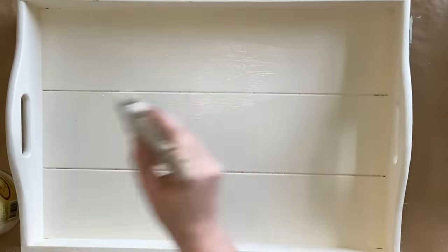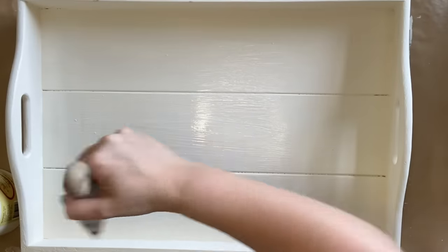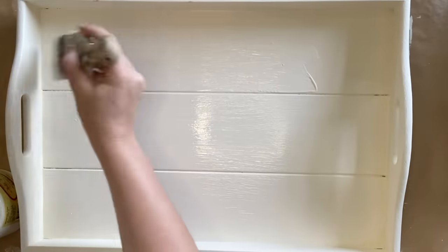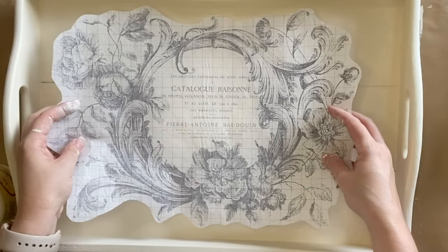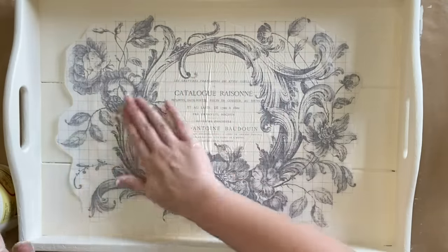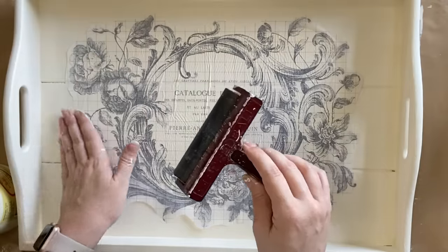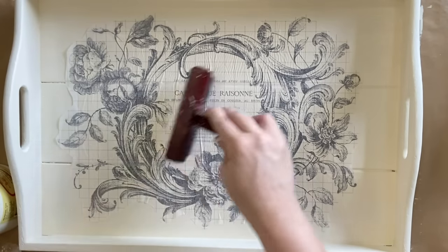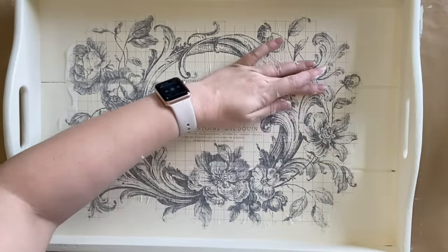Next, I'm going to apply an even coat of Dixie Belle's Silk Mineral Paint to the entire surface of the tray. I need it to be thick enough so that the paint inlay has something to actually transfer into and so that the paint doesn't dry too quickly — you must apply a paint inlay to wet product. I'm working pretty quickly to make sure this doesn't dry too fast, but I also need it to be even. Now I'm carefully pressing the paint inlay design side down into my wet paint. You should see the grid facing up at you, and I'm very gently pressing the inlay into my wet paint. You don't want to press so hard that you start moving the paint underneath, but you do need good contact. So I'm using a combination of my fingers and a brayer. This tray has little gaps between the bits of wood, so I'm going to very gently press the inlay into those so there's not such a big gap.